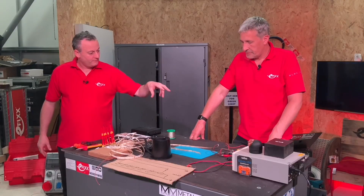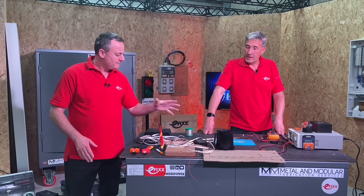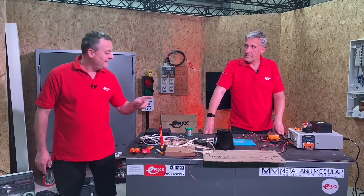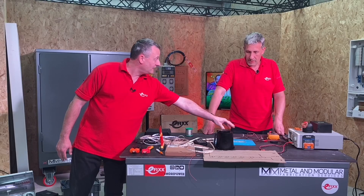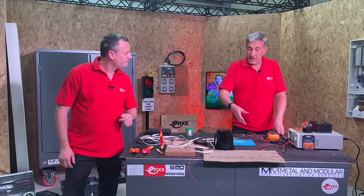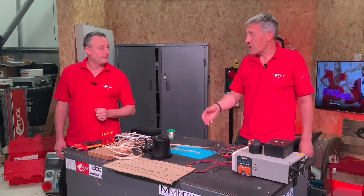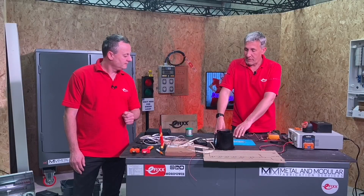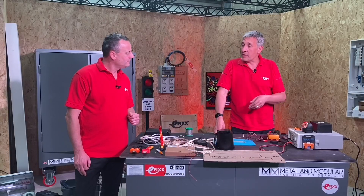To summarize: the current regulator in the Osram strip gives more uniform light throughout the entire length, whereas with the cheap strip you get a considerably different lux level at each end. You won't see it on day one, but on day 100 or day 300 you will start to notice it. The packaging on the cheap strip claims a life of 15,000 hours — but that depends entirely on the application.